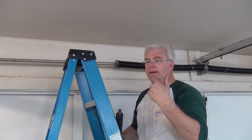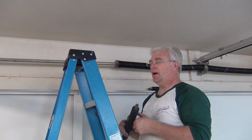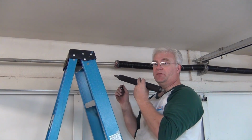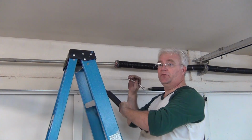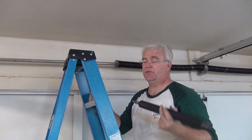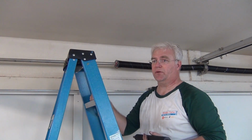I'm going to go take off those clamps on either side. And if I were taking this off, it's essentially the reverse order. I put one of these in and hold the weight on it and start loosening up the screws so that when the set screws come loose, the weight's on my shoulders. And then I just start doing the 2-pipe thing, backing it back out again until there's absolutely no tension on it. And if it's a 2-spring system, we go to the next spring and do that one. So that's the removal, just the same thing in reverse order, being very careful.